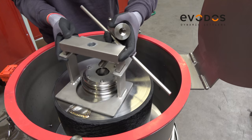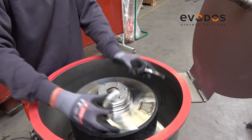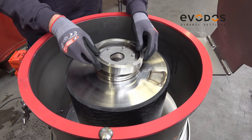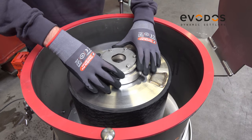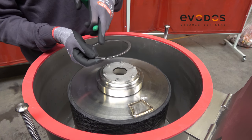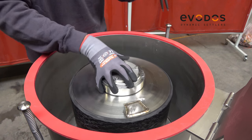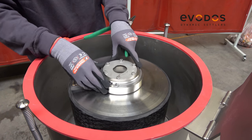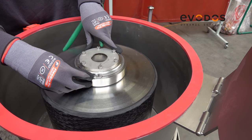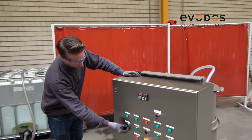When we remove all the tools, we add the securing components. Make sure that they are properly in place and we lock those with the ring. When mounting the circlip, make sure that the smallest holes point upward. Make sure that the distance here is a maximum of 11mm. We lock the drum with the mechanical locks and with the interlock.